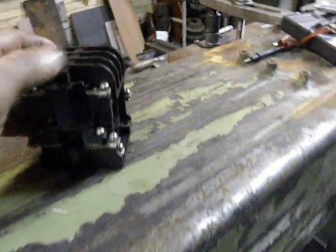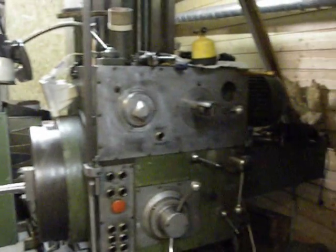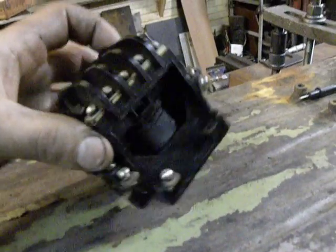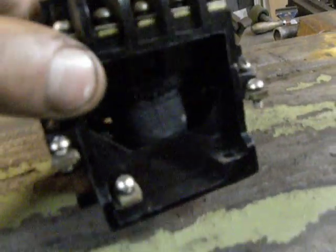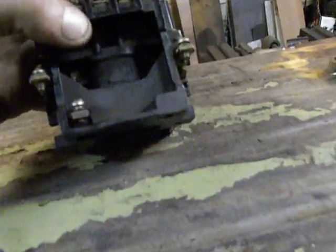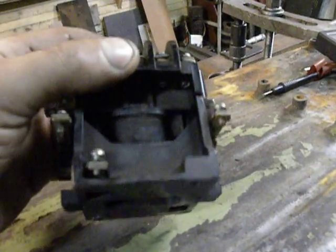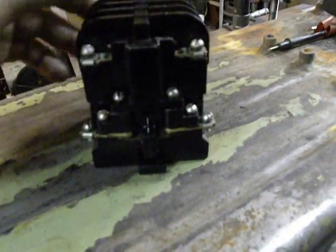Hello MapFactory. We just finished repairing my horizontal boring machine. It was broken down by one electrical part — this relay. The coil was burned down by fire and my machine broke down. I was lucky to get this piece and I could set it into my machine, and by this it works again.